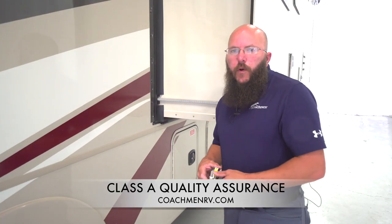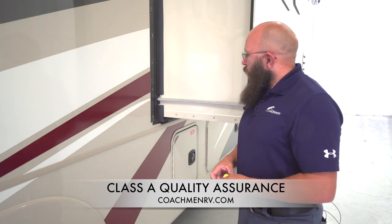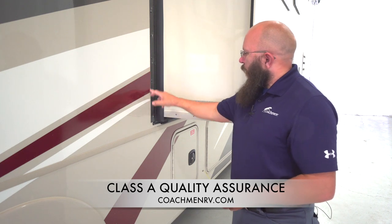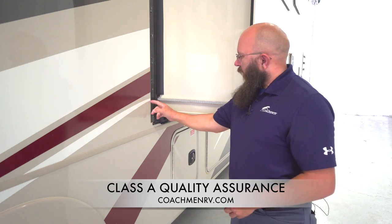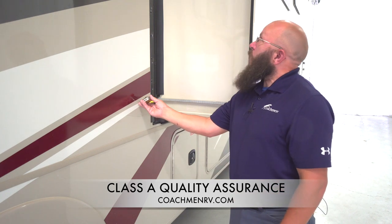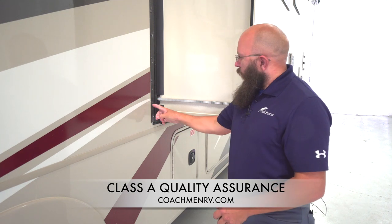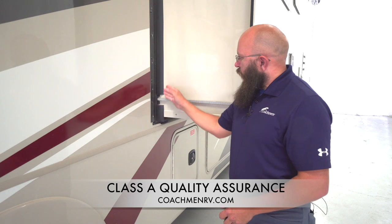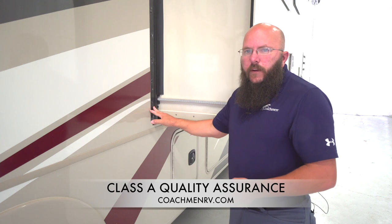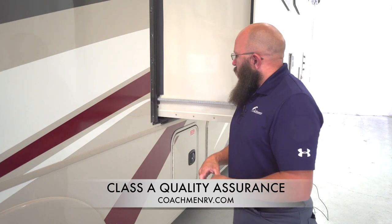Here we are back on the outside of the motorhome. A couple of critical measurements to cover today. The first one is the rack distance to the column right here. You're going to go from the end wall to the outside edge of the column — starting right below the gear rack on the top and bottom post. The measurement you're looking for is three and three-quarter inches to this outside edge. Make sure you're not on top of any of the rubber, as that will throw it. There's also a trim piece you'll want to remove to get an accurate measurement.